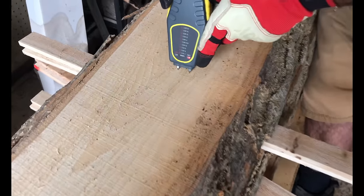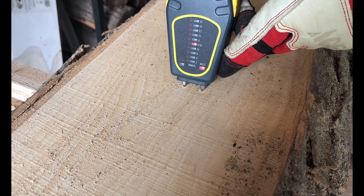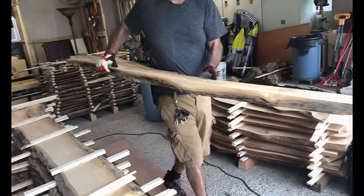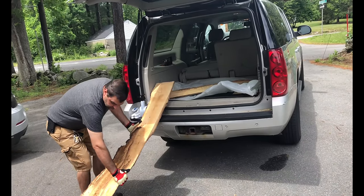When I flip the wood, I also monitor where it is in the drying process using a moisture meter. You can see that this board is at 10.5%, which is close but not quite at the 9 to 9.5% that we're shooting for. So it'll stay in for another ten to fourteen days.